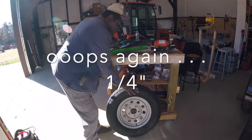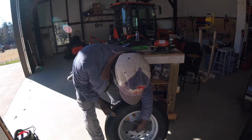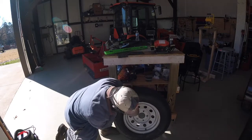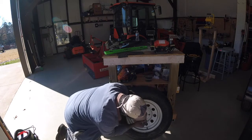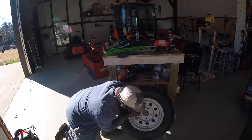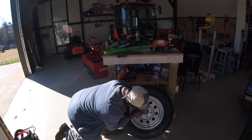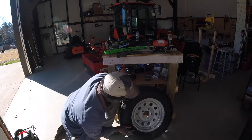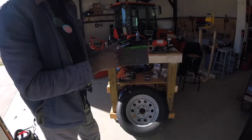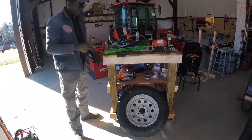Alright, here's a half-inch plate — it'll actually fit right in there, perfect. I'm going to hold it on the back of there, take my marker pin, and drill two holes, one on each side. I'm going to put a hole there and drill down to get something a little bit better, then take a drill and put two holes there, reaming them out so the studs fit.